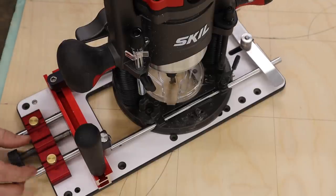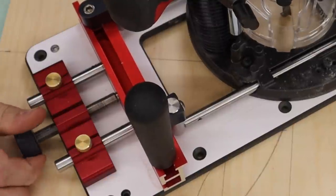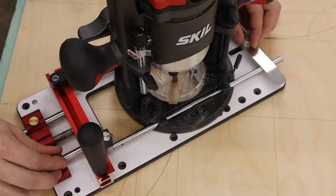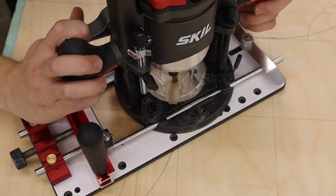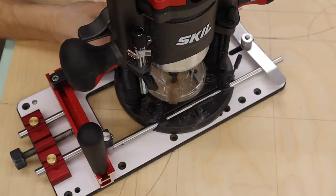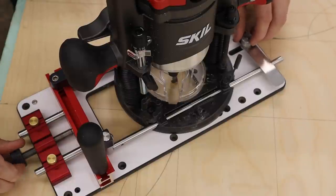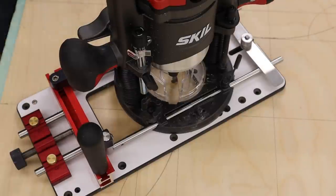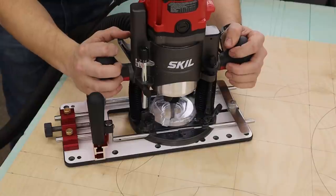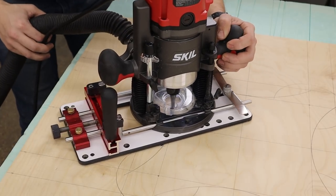All that's left to do before cutting is to dial in my router using the micro adjuster. The micro adjust on this tool is phenomenal — it operates very smoothly and makes setting up my cuts a much more enjoyable experience. With the router unplugged, I like to turn the router bit so that the top dead center of the bit is lining up with where I want to cut. Now it's time to start routing. I'm using a spiral upcut bit in my router. I like to start my plunge somewhere in the middle of the arc and then sneak up to the line where the arc transitions.